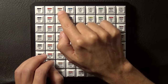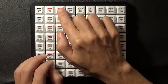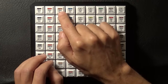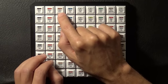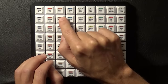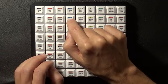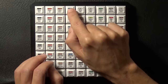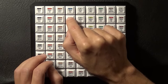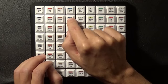No, of course, there are two values: the actuation force and the tactile force. The tactile force is 10 grams higher, so 45 to 55 grams. And here it's 55 to 60 grams, just like Cherry. And an actuation point of 2.3 millimeters.